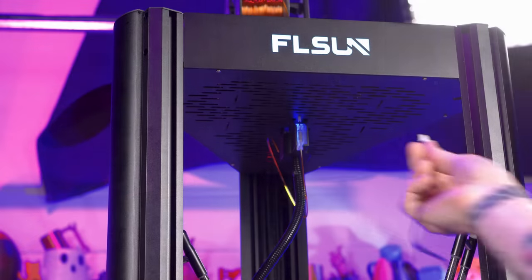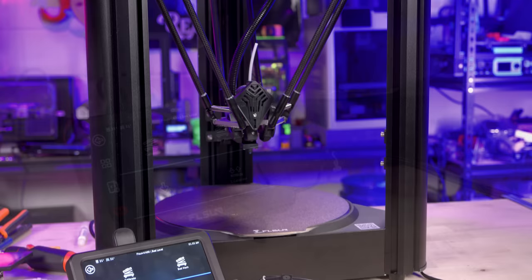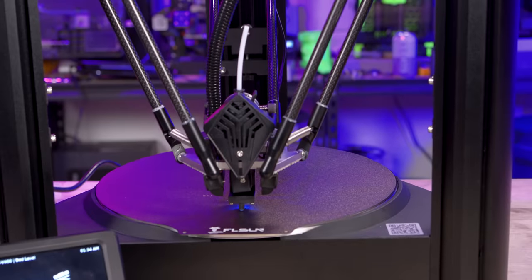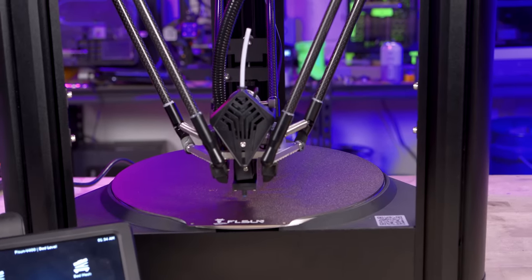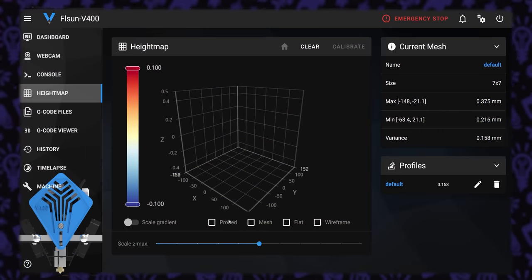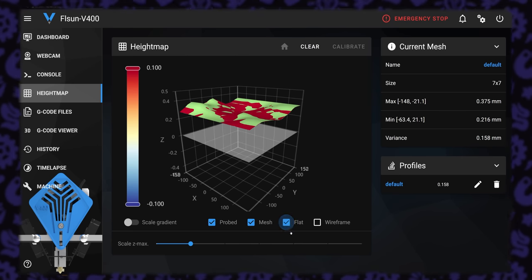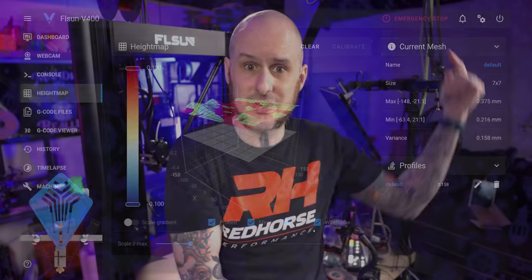This is really straightforward because it's already in the menu system on Klipper screen on the speeder pad. I go to configuration, bed level, calibration, then it asks me to connect the Z switch and magnetically attach it to the effector of the tool head. I hit continue and the machine probes seven points around the bed to calibrate the towers of the delta. We can then rerun a new mesh bed level — and look at that, when you actually calibrate something and run the mesh again, it has a decent height map.